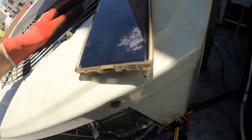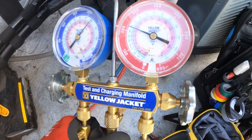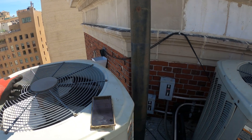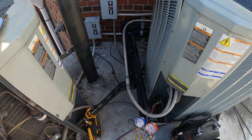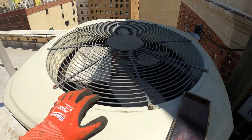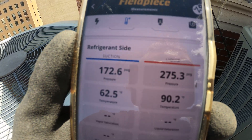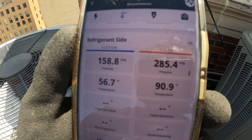We got a standing pressure of about 230 PSI — 236 on this one, and 225 standing pressure on this one. The coil defrosted inside; put all the covers back on. We've got clean filters, new contactors on both, and new capacitors on both. Let's start one up. Compressor started. This is refrigerant 410A. Let's give this a couple minutes so the pressures can balance out.